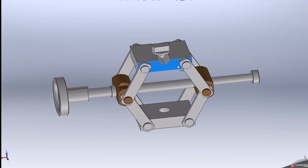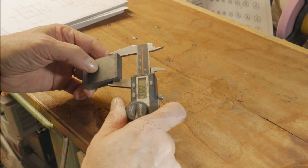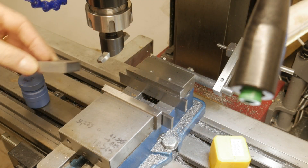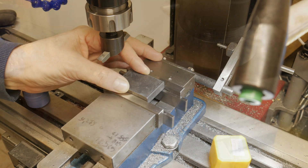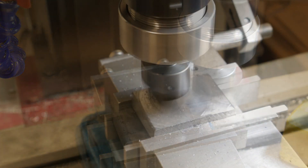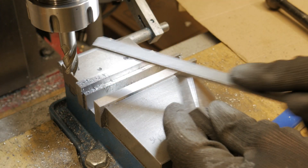This is my project and I will try to show you how to make it. The first step will be to make the two parallel bases, and for this I will use a rectangular bar. I will polish the faces with my fly cutter for the big surfaces, but for the smaller surfaces I will use my hand mill to square the bar.